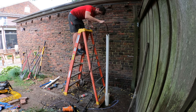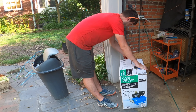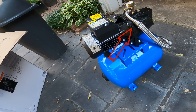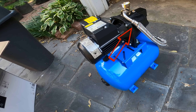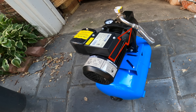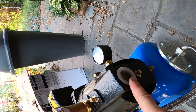I'm done drilling my 2-inch pipe as far as it'll go. At this point I decide to go ahead and get my pump set up — you can insert the inch and a quarter pipe first if you want, it doesn't really matter. This is the pump I got from Home Depot. Let me pause here for a second — one lesson I had to learn the hard way: if you look at that piece of hose right there, it's dented. This actually ended up mattering quite a lot because a few weeks after I installed this, the piece ended up blowing off the pump because it remains under pressure and a bunch of water leaked out. So I ended up using a different pump in the end. Make sure you visually inspect your pump closely before you install it. All these pumps are set up basically the same way — this is where water is pumped out, and this is where water is pulled in from the well point.